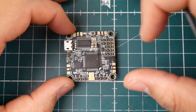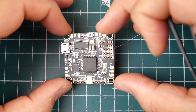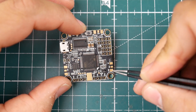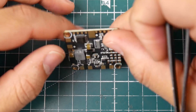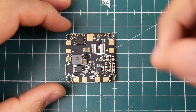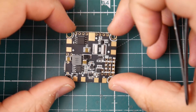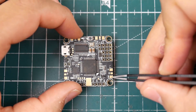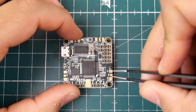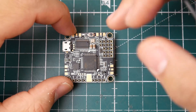It does have OSD like I mentioned, and it doesn't have a barometer on board. It's actually an all-in-one flight controller — when I first got it I was like, how is it an all-in-one? Because if you look here it says RX1, motor one, ground — but where's the power? The power is on the back side. I don't think this is going to be an easy build because you install the ESC power on the bottom, then on the top you do the signal, ground, and telemetry. It even has telemetry ready on RX1, which most boards are doing nowadays.